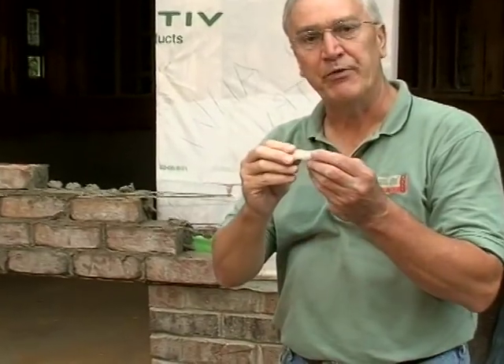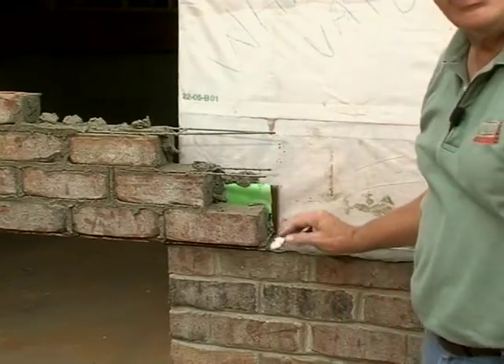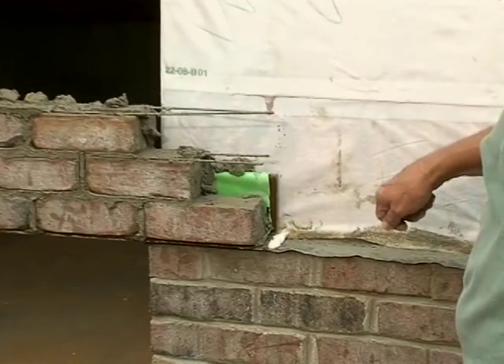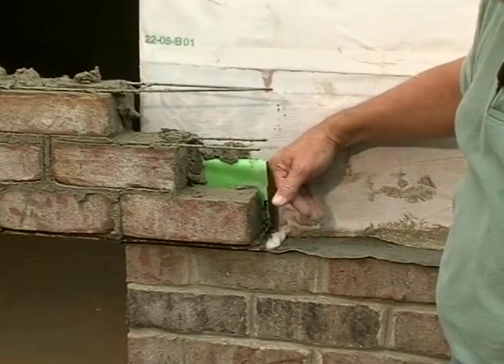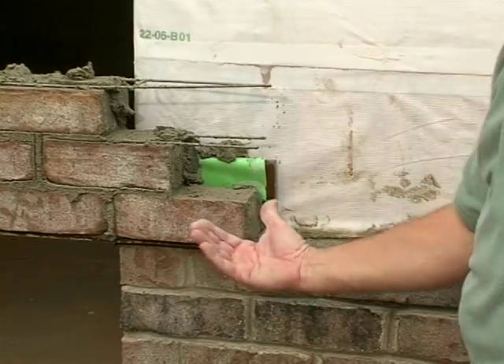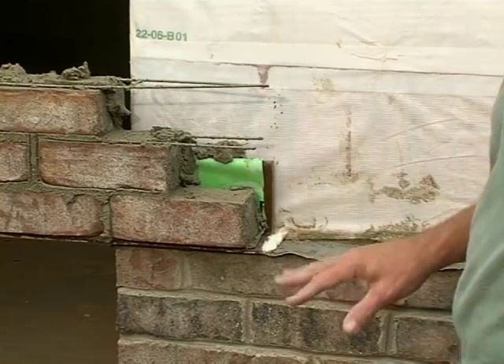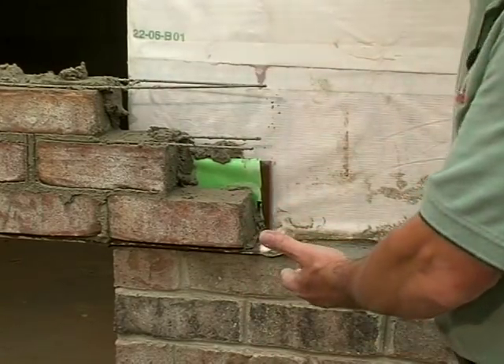I just picked up a little piece of insulation that was laying here on the ground — some type of compressible material. If it could just be laid against the end of that angle iron when the mortar is being spread, then once the brick are laid, there's room for that angle iron to grow in and out daily as it expands and contracts thermally, without pushing the brickwork. You don't have a problem if there's a large mass of masonry on both sides — only if there's a short return or if you're up close to the cornice. Just some small compressible material at the end of that angle iron to make sure it's not bound too tightly in the mortar and has room to move will do the job.